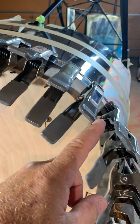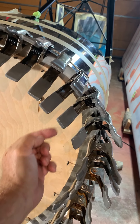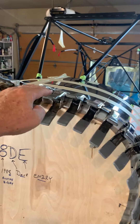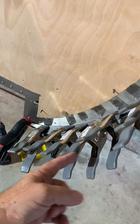Take six or eight clamps off — about this much — that gives you plenty of room. Then take both shims at the same time and put them up there, wrap them around, and come up here. As you start, take the next clamp off and put it here, then the next clamp off and put it here, just keep working. That way you'll have about a foot or 16 inches of work area as you go around. Instead of putting the clamps back on, just keep moving down, and at the end you'll take the ones from the top and put them back down to the bottom.